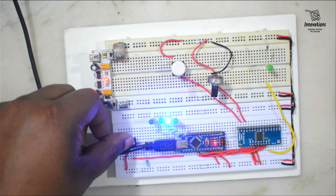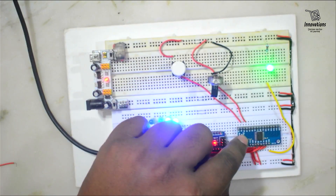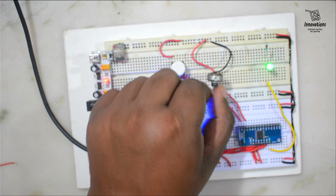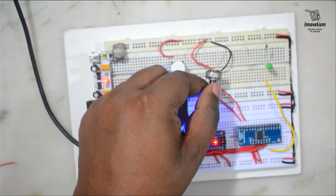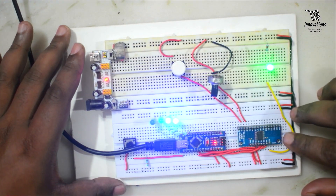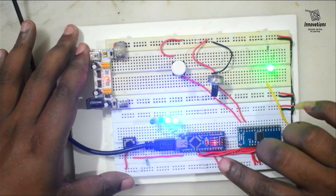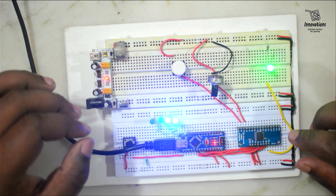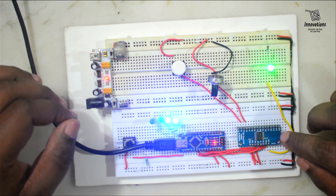Pressing the selector button again gives 0011, and this time the LED glows because the potentiometer is connected with C3. The potentiometer is in the high position, so the LED is bright. If we decrease the value of the potentiometer you can see the brightness of the LED changes. So this module works in both digital and analog mode. We can connect the signal pin to the Arduino inputs and connect multiple input devices. Just using only 5 pins we can select 16 input devices using this multiplexer module.